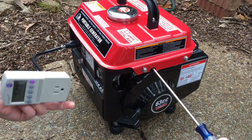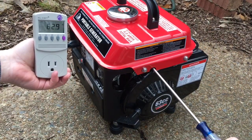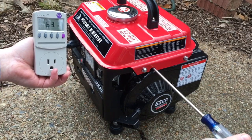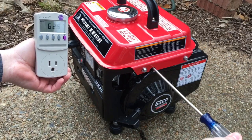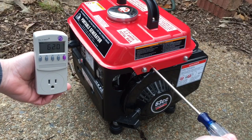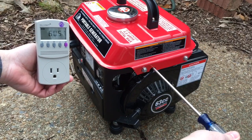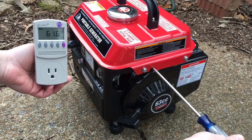I do this on hertz because it's a little easier to keep up with — it's not moving around so much. You're going to go counterclockwise. Now it looks like I'm going pretty far turning, but I'm actually having trouble keeping the screwdriver in the screw head. You'll see the hertz are dropping, which in turn is dropping our RPMs and our volts.